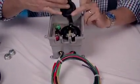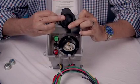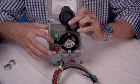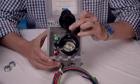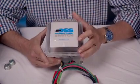Your 240 inlet for hooking up to generators with 240 volt power. Same concept as the 15 amp. You have your disconnect switch, middle position. After you install it, the green light will be illuminated. This is your utility power coming in. You close it up, you leave.